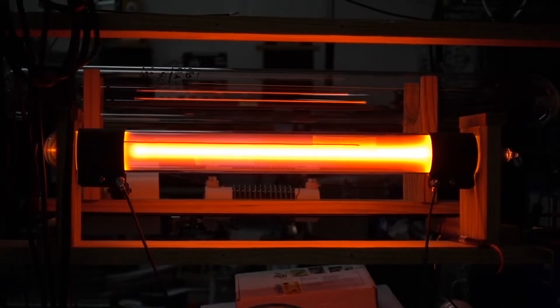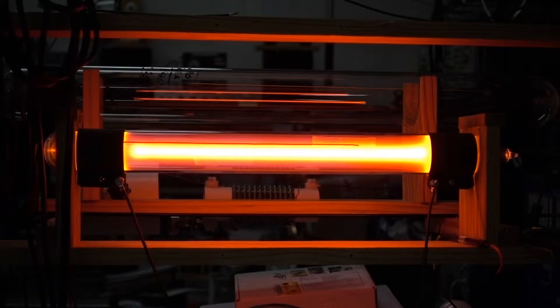Now that the tube has been running for a few minutes, there's a very slight purplish glow around the outside of the central discharge. It's not apparent in the video because the camera is not responsive to that color. This is normal operation caused by driving gas out of the wall of the tube where it's heated under the electrodes. The getter will clean that up after some period of time.